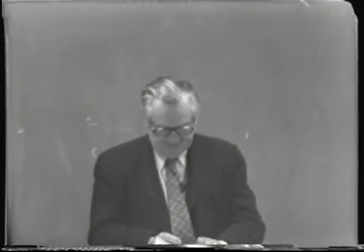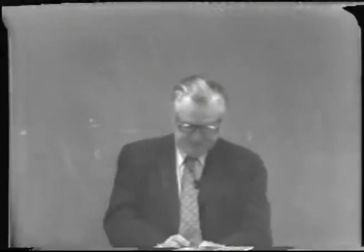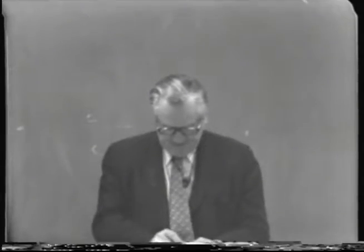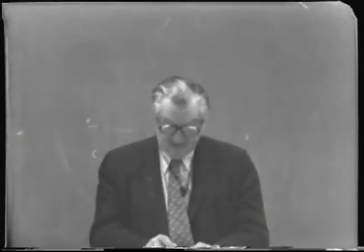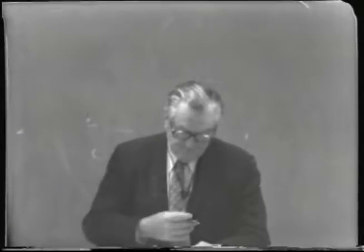But the bulk of the alcohol, of course, will come out the bottom again, also called unfinished spirits. So in other words, the unfinished spirits down at the bottom are fed into the final concentrating column, or rectifying column, the spirits column that's labeled here, from which high quality spirits are drawn off as a side stream. Some light heads distillate is probably collected and fed back to the heads column. I'm not tracing this out exactly. I don't see it offhand, but I think that's the way it goes.